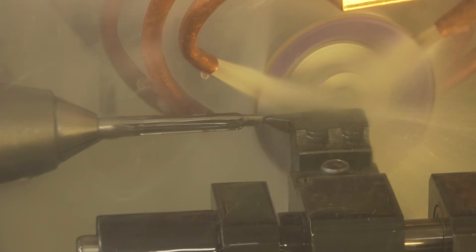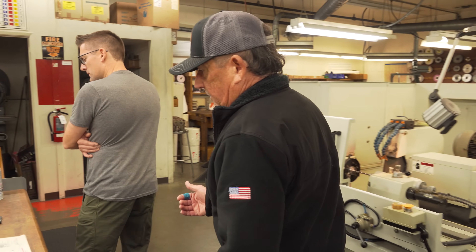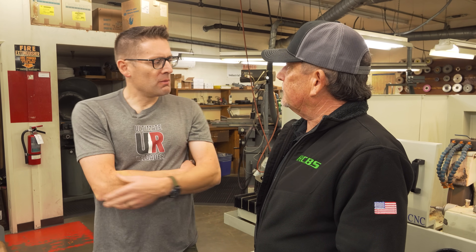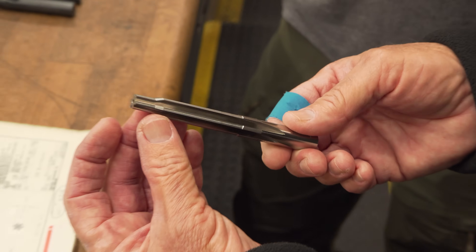They're currently grinding what looks like a .223 sizer die reamer, using diamond wheels — or possibly one of the other abrasive compounds. Everything in this plant is heavily inspected because we make top-quality tools and we don't want anything bad going to the customer. There's also a ground .308 sizer die reamer not quite finished yet — they pre-drill the body and neck, and because you just machined that surface, the reamer goes in and finishes, setting the geometry perfectly true.